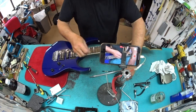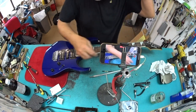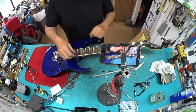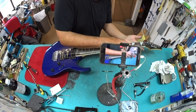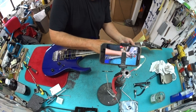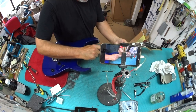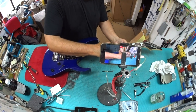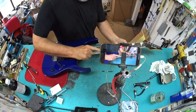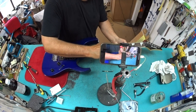So now what I do is I move this string to the side and I spread it out down the bottom with my little rubber spacer, and lo and behold, I start the leveling process with this tool. And all the time when I'm using this for the first pass on a guitar like this, I'm looking to see where the tool's cutting. It's got 400 grit sandpaper on it, wet and dry paper, so it's a very delicate or very gentle cut.